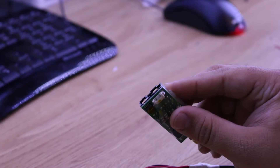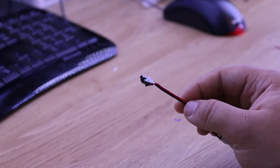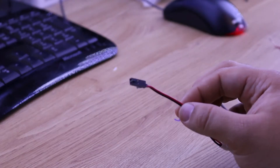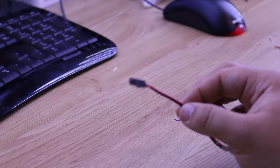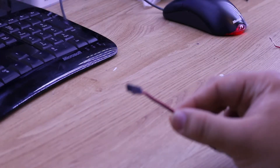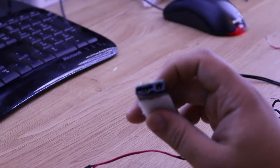I didn't need the socket, but the socket can be easily found by knowing what the plug is. The plug here is a Molex SL series type G locking, and this one is Molex part number 50-579402. The two corresponds to the number of pins, which means if you want the five-pin one that goes in the other port, you need a 50-579405.